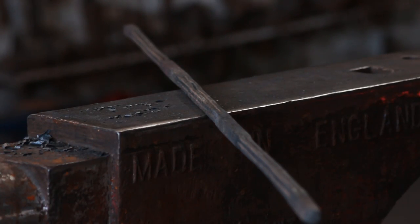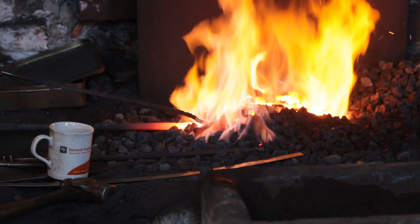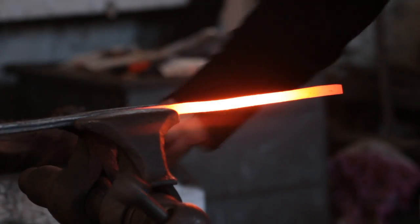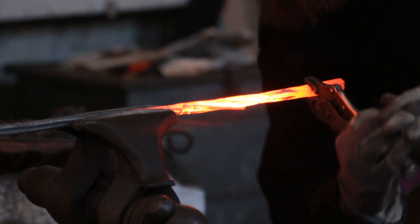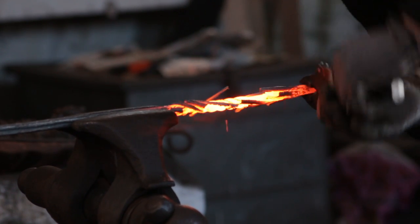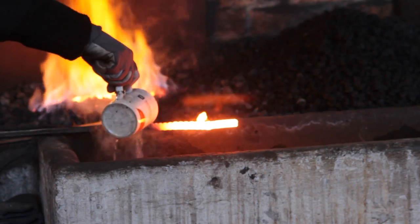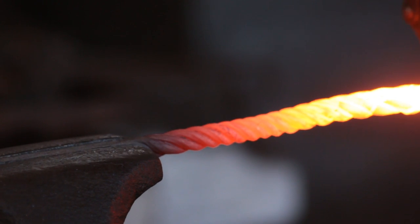At this stage we are going to put a twist in. Get an even heat — if you're working with a coke fire run it back and forth; with a gas forge that shouldn't be a problem. With iron, get a nice warm heat otherwise it risks splitting. I'm twisting this one counterclockwise, and the eight-inch section in the middle I will also twist counterclockwise. If your twist goes unevenly, cool off the part with the fastest twist and help the slow twist catch up. There are plenty of good videos on YouTube on twisting so I won't drone on in detail.